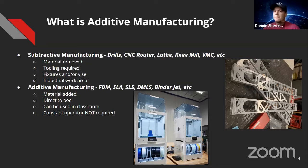Under additive manufacturing, almost every form adds material — whether it's powder-based, solid state from pellets or liquid resin, or a liquid infused with a solid like nanoparticle jetting. The basic concept is that material is added and it always happens on a build plate. Once you print on that build plate, you take the part off — there's no part setup, no fixture setup, no time spent on soft jaws. These can be used in classrooms, run off standard 110 outlets with little noise, and once you start your print, there's really no operator that has to stand by it.